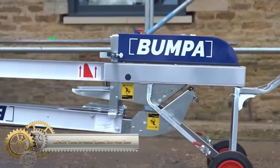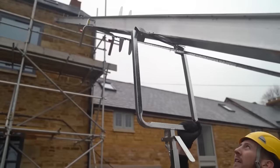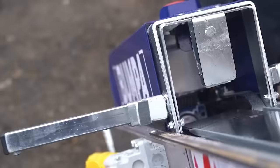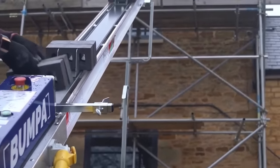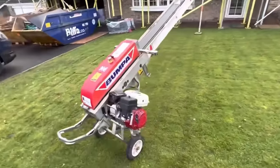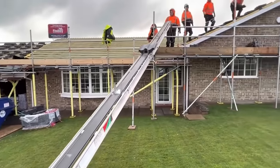The Weller's 8-meter electric bumper hoist is a highly efficient and reliable tool designed for builders and roofers in need of a convenient material lifting solution. Powered by a 110V electric motor, it effortlessly lifts various materials, including roof tiles, slates, bricks, blocks and more, up to roofs or scaffolds. With features like a continuously moving belt with material supports, quick setup within 10 minutes, and a high lifting capacity capable of transporting a pallet of concrete blocks in under 2 minutes, the hoist significantly enhances productivity. Its powered reverse function allows for quick return of unused or salvaged material, contributing to both efficiency and safety.